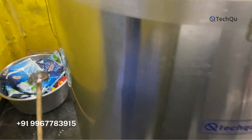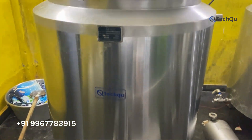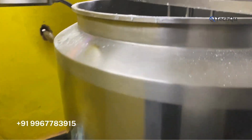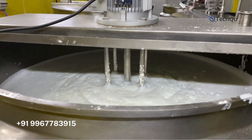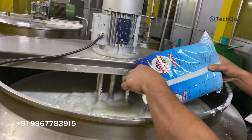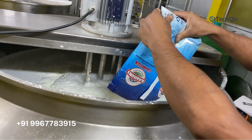The main three core points of the liquid mixer machine are: First, the liquid mixer machine has three shells. The inner shell contains the product, the intermediate shell contains water which we heat, and the outer shell contains insulation. This reduces heat loss by insulating.